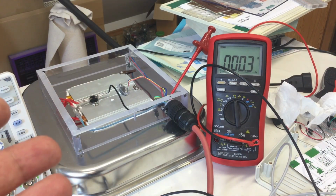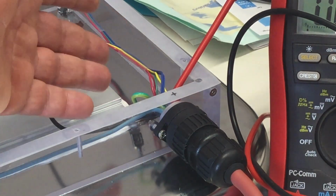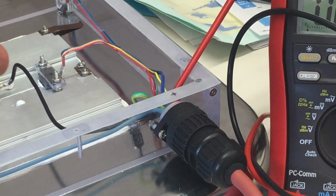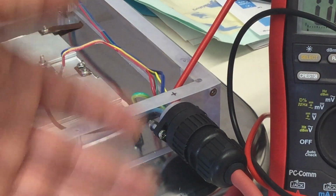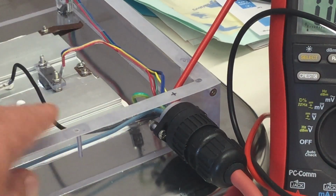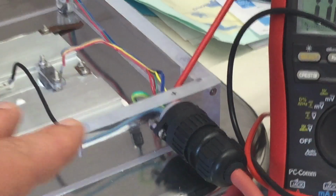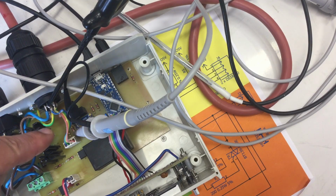The only thing I can think of is that somehow a wire is broken here. But these are hookup wires. They might break. But the 5-volt connection broken to both sensors? I don't think so. Or both sensors may be damaged from the very first test. The cable link that failed got quite warm in here, but no, I don't think so. Especially the sensor back here, which gives us more frequent bad readings. No, can't be. So let's get back to our two pull-up resistors down here and make them smaller.